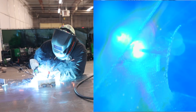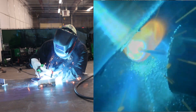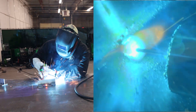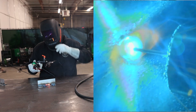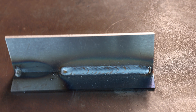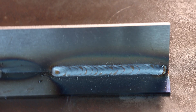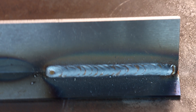A little bit of a cold start — that was probably more me. I kind of long-arched it on the start. Going along though, we're getting a little bit of spatter, but it's pretty soft — not real hard, big chunks of spatter. Probably could have gone down on wire speed just a little bit. That's why we offer some fine-tuning in the power set mode, because if you're doing a little more of a push, a little more of a drag, or a little long arc, it will affect those settings a little bit. But as you'll see in the final shot, it was a pretty solid weld — there was a little bit of spatter, but nothing too crazy, ran pretty nice. I was about 12 to 15 inches per minute lower on wire speed earlier. I thought it ran a little bit better that way, but it kind of depends on your position, your gap — if you've got a little more of a gap, you could use some more wire. So overall, pretty darn close.